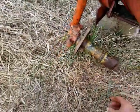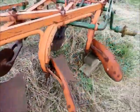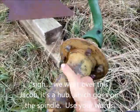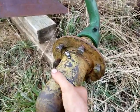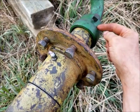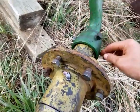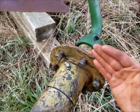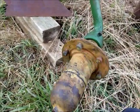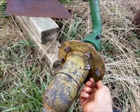Got the spindle cleaned up and the shaft put all together — all cleaned up, all greased, ready to go. It's nice — there's just a shaft collar on the shaft so you can tighten up these two jack bolts wherever you want to adjust end play. Got just a little bit of end play there, everything spins nice, all the lug bolts are cleaned up, so ready for the wheel.